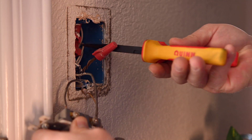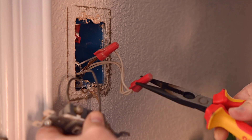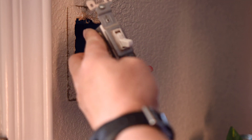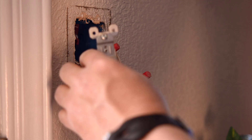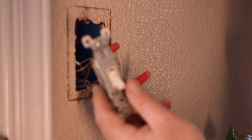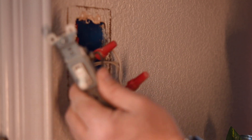The wires may be a little difficult to pull out — using a pair of pliers will help. For the insulated wires, don't pull on the insulation so as not to tear it. Grip by the plastic wire nut or the bare wire instead. Double-checking the toggle switch for electrical power never hurts. It's also a good idea to check the wires for any tears.